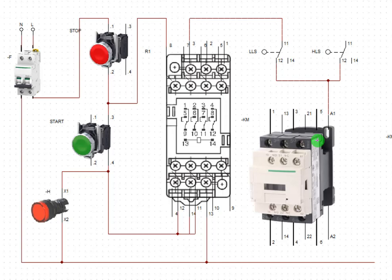Now, the next thing we need to do is to latch this contactor. We just fed the coil, so we need to latch it, because when it closes, it needs to latch and remain latched until we disable it with these two. So these two flow switch sensors are going to control this. So let's latch it first. How do we latch it? We latch it through this one. This one should come out.